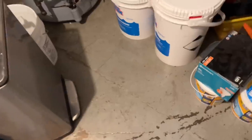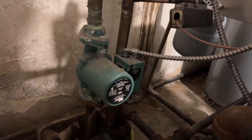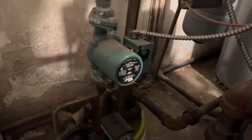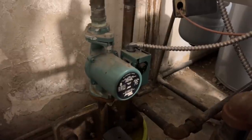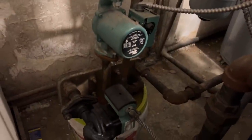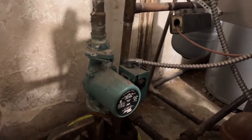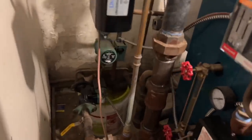And let's see. In case you're all wondering, it's that one. Not that one. That one. And that one is leaking because that expansion tank is no good. If there was a relief valve on it, that would have gone first instead of the circulator being sacrificed, because it's got too much pressure on this hydronic side of the brazed plate heat exchanger, which caused the gaskets on the motor head to fail and start leaking like a sieve. So now we're going to install a relief valve.